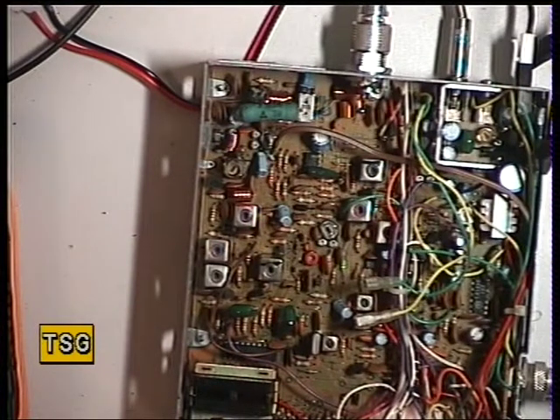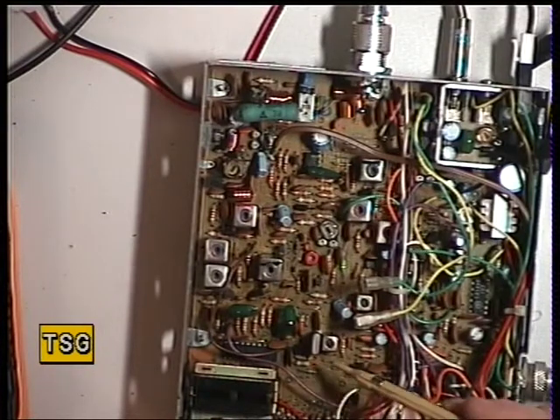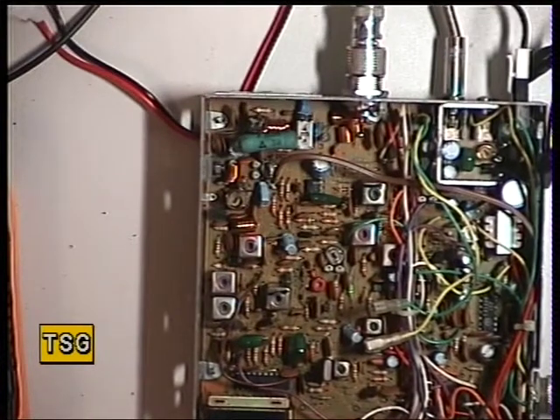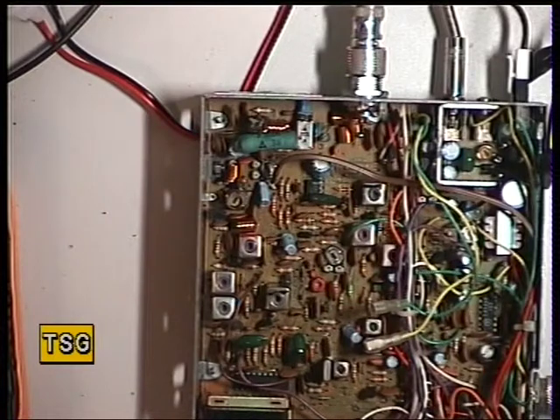Only just though — 27.79122. As the crystals age, the frequency drops, so that's something to watch for. If you can't ever trim it up, the crystal needs replacing. But considering these are now 30 years old, I think they're doing pretty well.